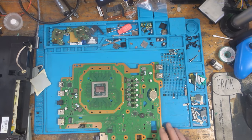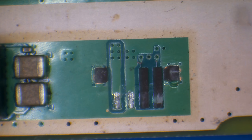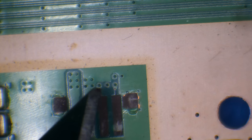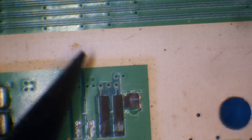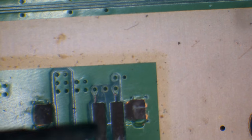Under the microscope you can see the extent of the damage. We've got the 12-volt connector just off to the side, and then we've got this connector — or what's supposed to be a connector — which handles the five-volt power supply standby. The console itself won't actually output 12 volts until it's told to. We've got a five-volt line, a ground, and a couple of lines for signalling — one is AC detection. It needs these four connections to make contact with the power supply, and then the console will tell the power supply to turn on and output 12 volt.